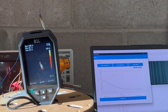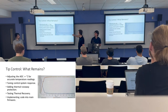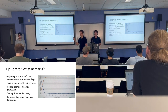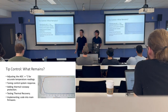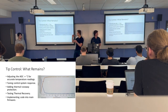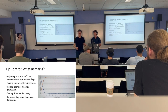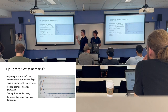There's still some tuning to do, and we haven't tested it in an actual soldering environment where the thermal load varies with how much metal you're heating. What remains: the ADC-to-temperature lookup table needs calibration for accurate temperature readings, the control system response needs tuning, thermal runaway protection needs to be added, thermal recovery during actual soldering needs to be tested, and the system needs to be integrated into the main code.